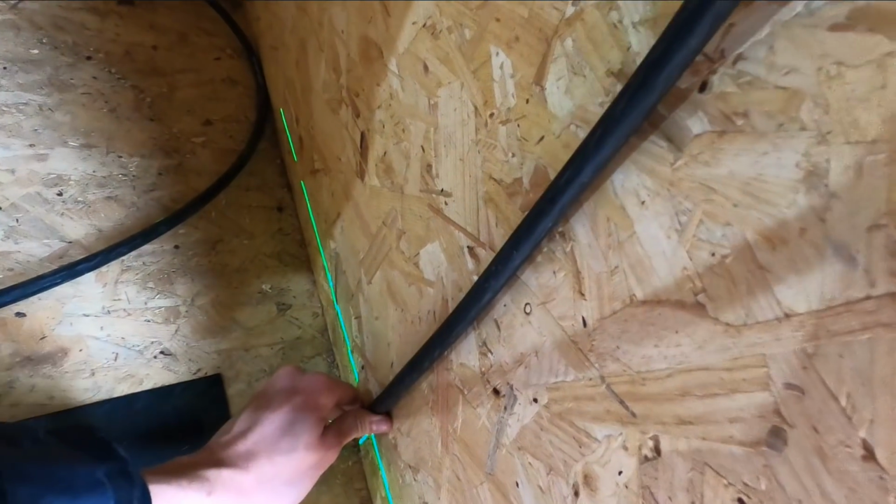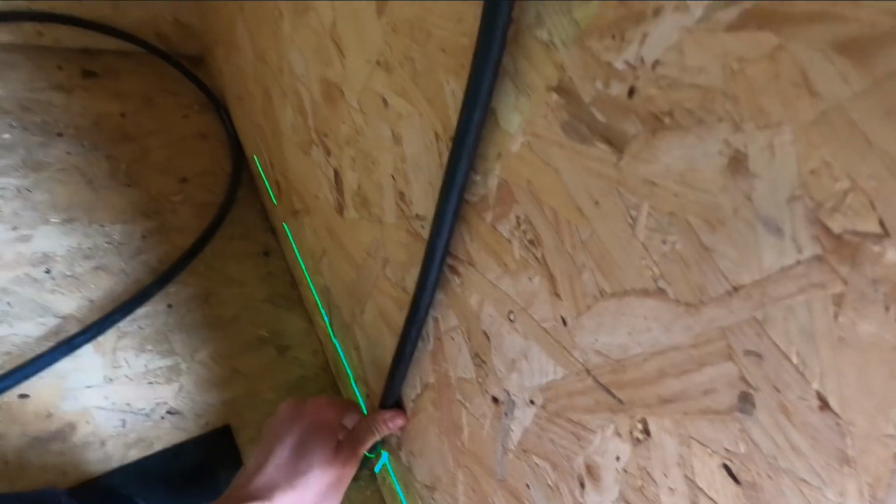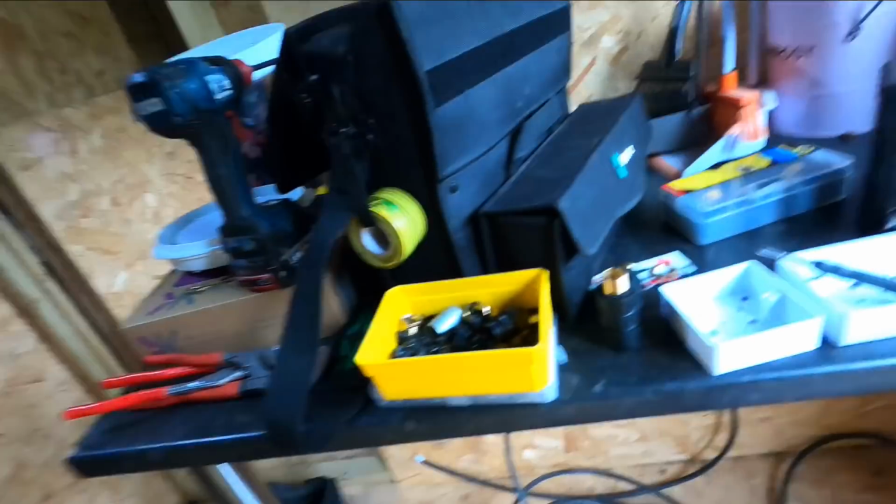Because that cable's going to want to bend left, right and centre because it's never perfectly straight. If you shift it either to right or left, whichever side you want to put the screws in, put it on that screw. If you go straight up from there, then you just put your screws in at that level and then the cable will follow us in a straight line, mate. I'll chuck that here, mate, and I'll run through what I'm doing.